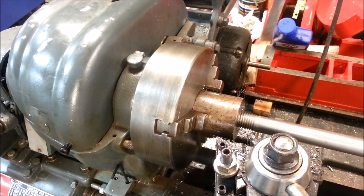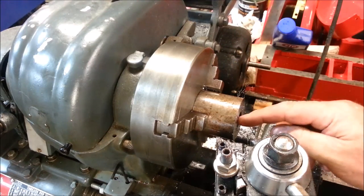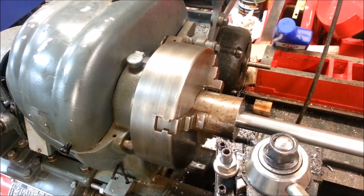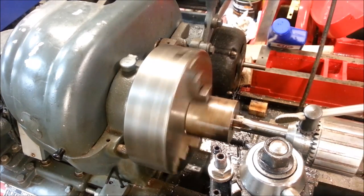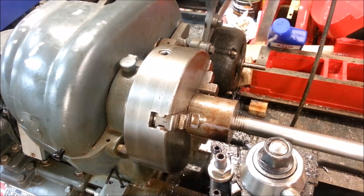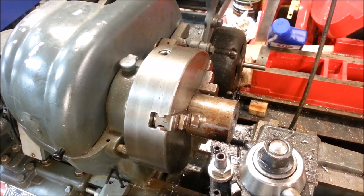That's a close fit. It's a tight fit — I may have some debris in there or a bump on the shaft. We may have to run that ream in there a little longer. Just make sure I ran it all the way through. Oh yeah, that's all the way through. I probably got a little burr or something right here. We'll work on this shaft. I think we got a good hole here. Well, I think it's time to call it an evening.